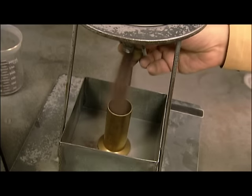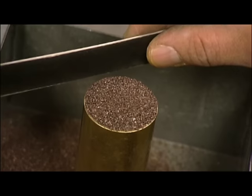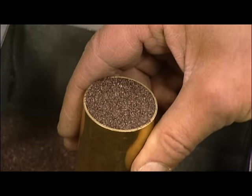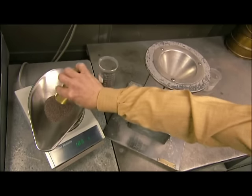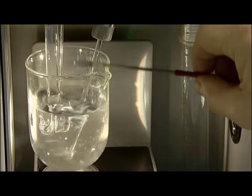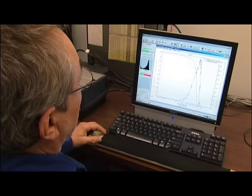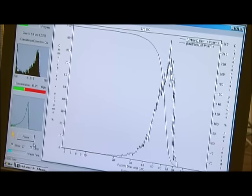To find out how the coarse abrasives shape up, they funnel them into a cup and weigh the grains. A higher weight means they're densely stacked and therefore blockish in shape with blunt edges. A lower weight means they're flat and sharp. They use a different test for the most minuscule grits — they suspend the particles in an electrolyte solution, then apply an electrical charge, which allows them to count and evaluate the grits.